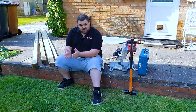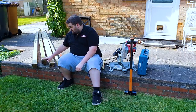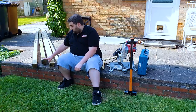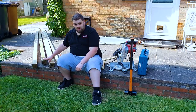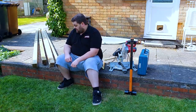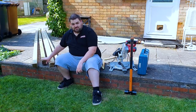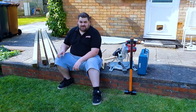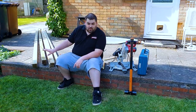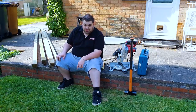That leads on to the vertical support timbers themselves. I've got some 75mm x 75mm treated fence posts - now these will be absolutely overkill, they're solid, especially to hold up what is a double track mainline for O-gauge. These are designed really to hold up four six-foot tall fence panels, so it's definitely going to last the test of time. And all the wood I mention I will, when it comes around to it, paint again in fence paint.